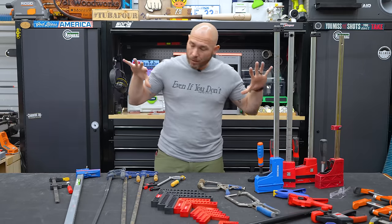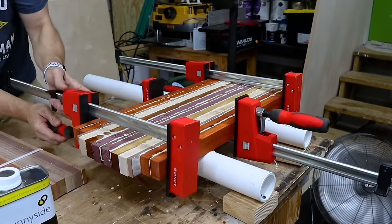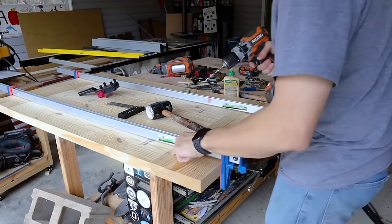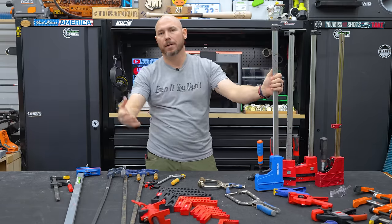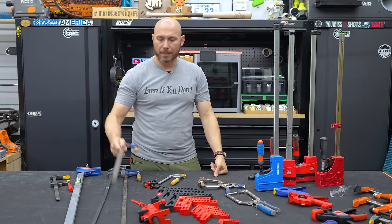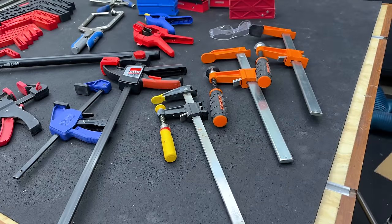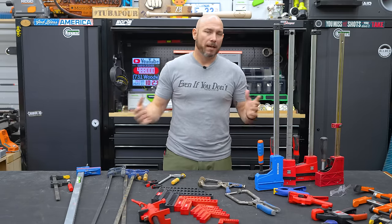What size do you need? It just depends on what you're making. If you're making a lot of cutting boards, a 24 or 36-inch clamp will be perfectly fine. When you start making tabletops, you'll want bigger, longer clamps. For parallel clamps they come in 24-inch, 31-inch, and 50-inch. On F clamps, I prefer the 36-inch but it's always nice to have some smaller versions as well. Having a good variety is nice, but if you only have the budget for one size starting out, 36-inch seems to be the best middle ground.